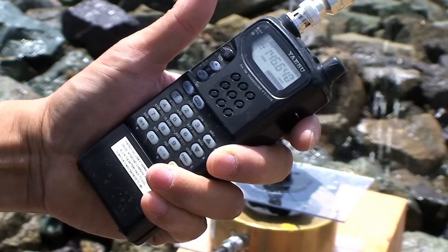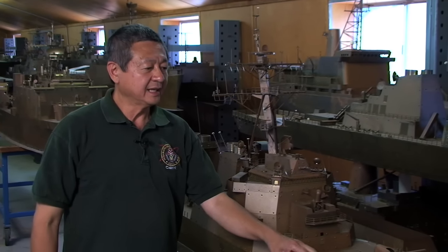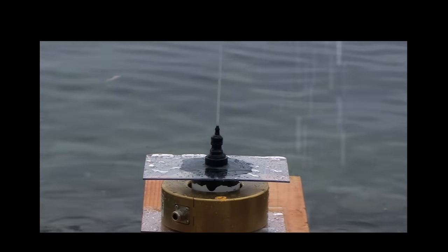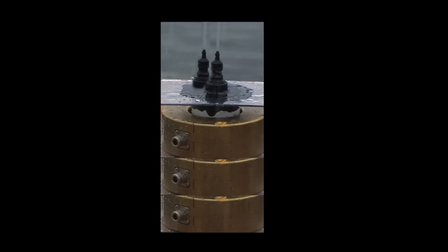The advantage of the seawater antenna is that we no longer have the topside real estate restrictions. We can place the antenna anywhere along the deck of the ships. Another advantage is its reconfigurable and multi-function design — potentially you can have multiple current probes stacked on each other and spray with multiple substreams to simultaneously perform HF, VHF, and UHF operations.